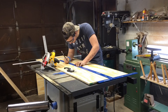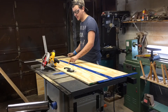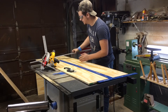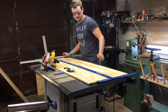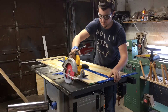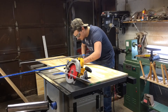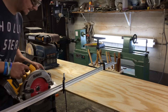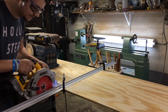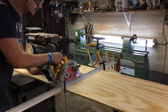I go an inch and a half and put a mark right there, then put my cutting guide on that mark so I can rip perfectly on the line. I pour the guide on the other side of the wood and use my circular saw, keeping pressure towards the fence and cross-cutting them all.